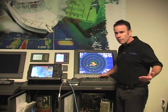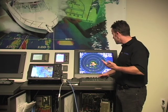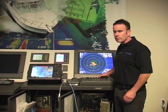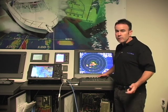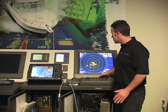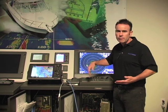For those of you who have already installed and set up an X7 series radar, you'll know that you need to do the routine things like heading adjustment, tuning adjustment, auto-tune initialization, timing adjustment, and you'll also want to get into the installation menu just to make sure that everything's set up right. I'm going to show you a couple of things specific to the NavNet 3D installation that you want to make sure you've got.